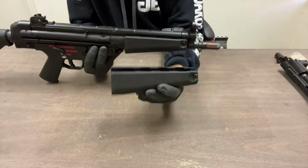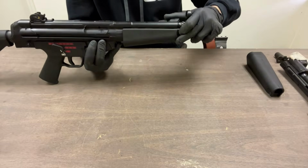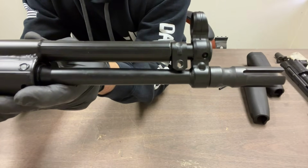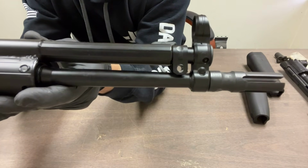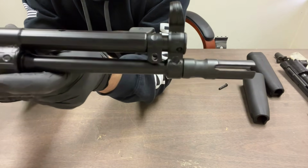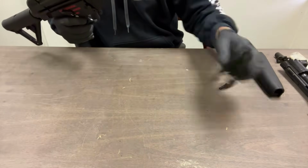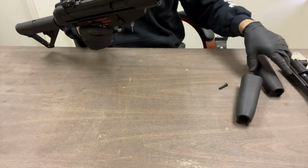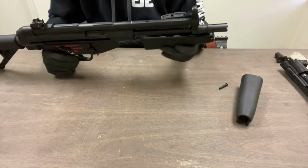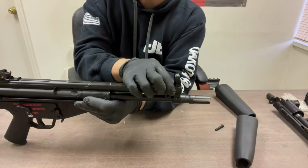The factory German handguard did not fit this sample. We already went through a bunch of things. I've examined some things here. The hanger actually is bent forward, and it's bent forward because it was welded too far back on the tube. So at the factory, they probably took some type of fixture or jig and tried to bend it forward to get this handguard to fit. And when trying to fit a German handguard, the point at which the push pin doesn't fit, the hanger is pushed too far back. The cocking tube is not centered in the front sight frame.